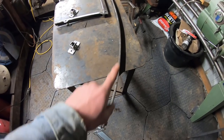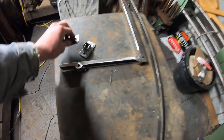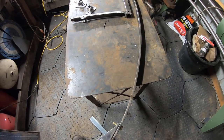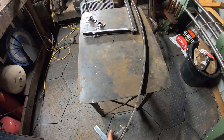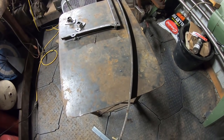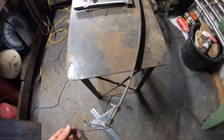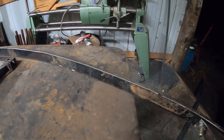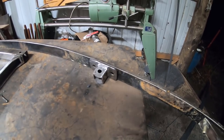I have to make sure this is where I want it relative to where my foot's going to be. My leg will be running down, my foot across, and I want this to be as aligned as I can get it with the center of the bottom of my foot. For me, the equidistant point between there and there happened to be at 13 inches, and that's exactly where my pivot point will sit. More drilling in spring steel — yay.